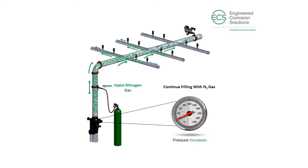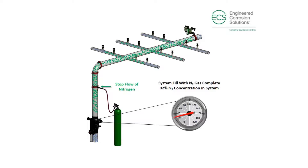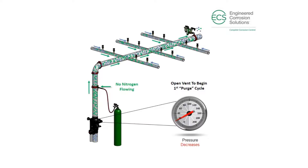After we're at 30 psi, we're going to go back to our vent, whichever is installed at the other end of the building, and we're going to take a nitrogen reading. After the first fill, we're usually around 91 to 94%. After we verify that our reading is where we want it to be, we'll purge the system. We'll likely purge from the auxiliary drain since we have one on this system — that's the easiest and best way to mix the nitrogen.